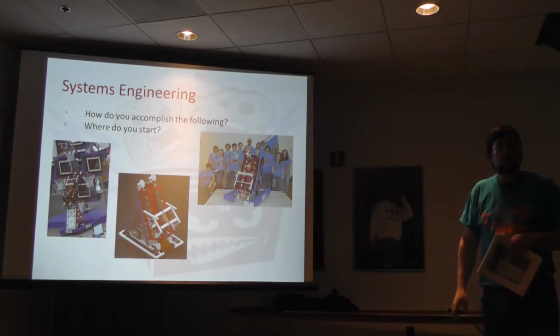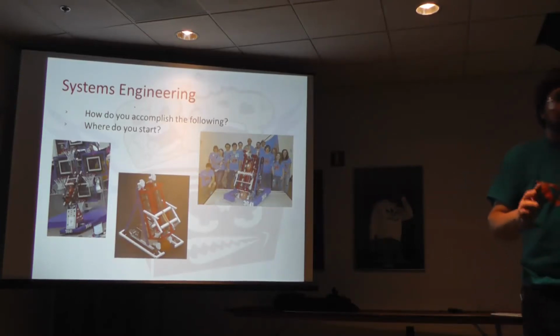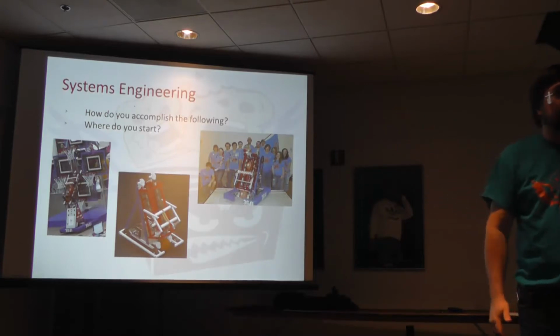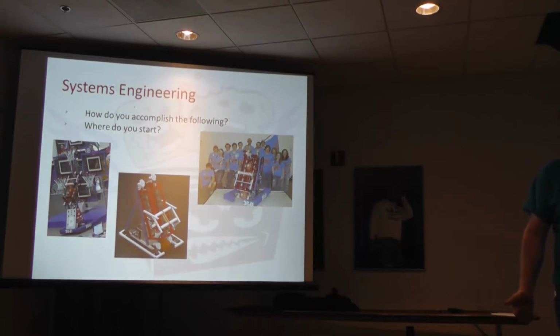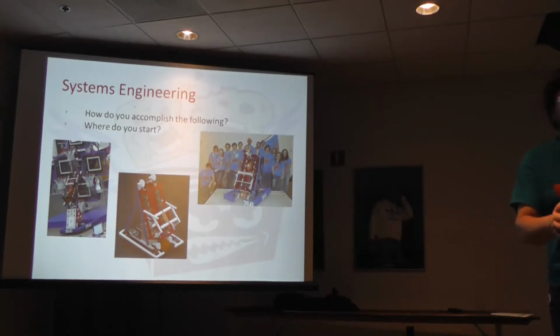If that makes any sense. And doing so, I don't know if you saw our robot, it's very small, very agile. We can target 180 feet. We can put it into a kiddie pool at 180 feet. All the shots, we're taking the paint off the side of my classroom, shooting 80 feet. The Frisbee comes out at 95 feet per second, which is 65 miles an hour. That's what we're shooting from. It's highly accurate, but it's a very simple robot because we went to those very important traits that QFD pointed out.